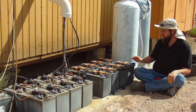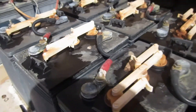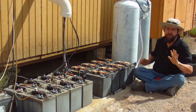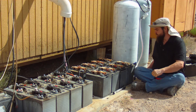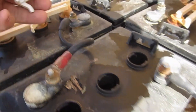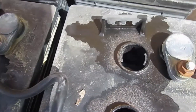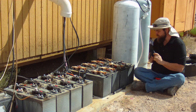Make sure that your batteries are clean — I just sprayed these off. Make sure there's no dust or dirt that could get inside the cells, because if you get any dirt in there you can't get it out. Make sure it's not a terribly windy, dusty day. Take the battery cap off and set it aside, and you can look down inside to see the water level in the cells. I'm going to need to add some water to these soon.